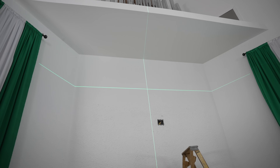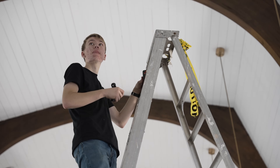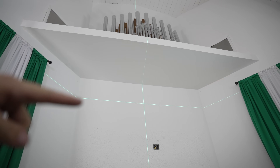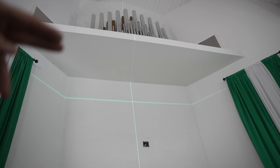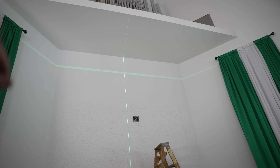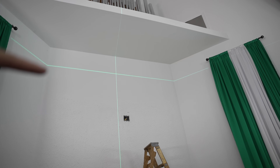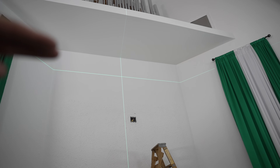When installing your LED screen it's very handy to have a laser level. Levi is up on the ladder securing the laser at the right height, and we're going to measure exactly where we want the top of the screen to be with that horizontal line. They said they wanted the screen about a foot below the ceiling under the organ pipes, so we'll measure precisely with a tape measure — it's probably going to be around 13 and a half to 14 inches down, because we don't want the wood backing to go all the way to the top edge of the panel.